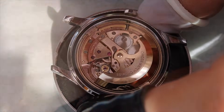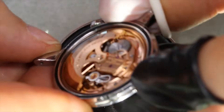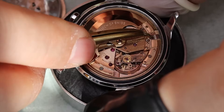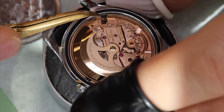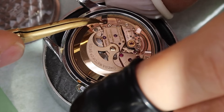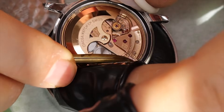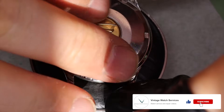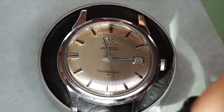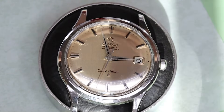It's a pretty straightforward service this time. What we're doing here is seeing if the rotor stays at the bottom of the watch when we rotate it — that's a rule-of-thumb test to see that the rotor rotates freely. It will rotate more freely the less wound the watch is. We're putting back the case screws — these clamps are a little bit tight, but that's how it should be. With this particular watch, there's a little crack in the bezel at around 10:30. We could try to laser weld that but that will have to be some other time.